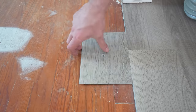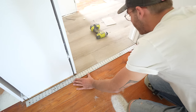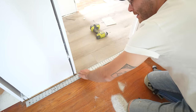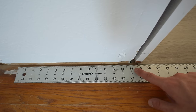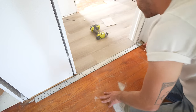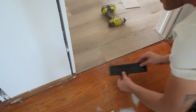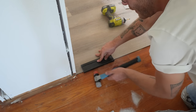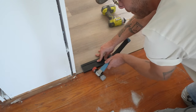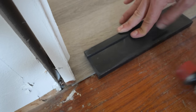Back to our actual doorway — the first thing I'm going to do is take a straight edge and bump it up against my existing edge. Looking at the wall for reference, I can see I'm flaring out just a little bit, and double-checking with the seam in the existing wood floors I can tell I'm out by about a sixteenth of an inch. My plan is to use the tapping block to scoot the floors back just a tiny bit, and in this close-up shot you can see I was able to move it — I think that's perfect.